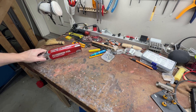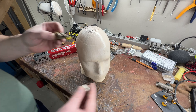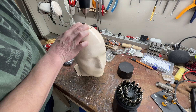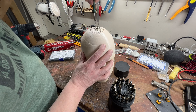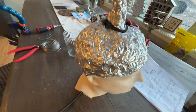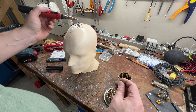So let's do a quick experiment and find out: will it ham? I've gone online and found a ground plane antenna calculator and from there I can get some basic measurements. I made the single wire that comes up through the top of the tinfoil hat much, much longer in case I needed it, and I trimmed it down. You're going to notice that the SWR and the return loss on this is absolutely horrific, but we're not going for the perfect antenna — we're going for something that will transmit.